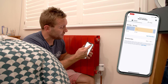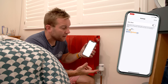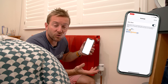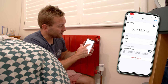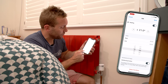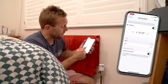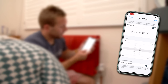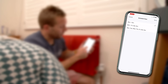We can change the schedule by clicking the cog icon. There's an 'early start' feature — if your heating takes half an hour to reach temperature, turning this on means the system will fire up early so it's ready when needed, like when a shop or pub opens. You have Monday to Sunday time blocks; you can set a temperature like 21°C to start at 6am and go off at 8am. You can then add another time block for the evening. The timer setup for hot water, heating, and each individual radiator is very self-explanatory.